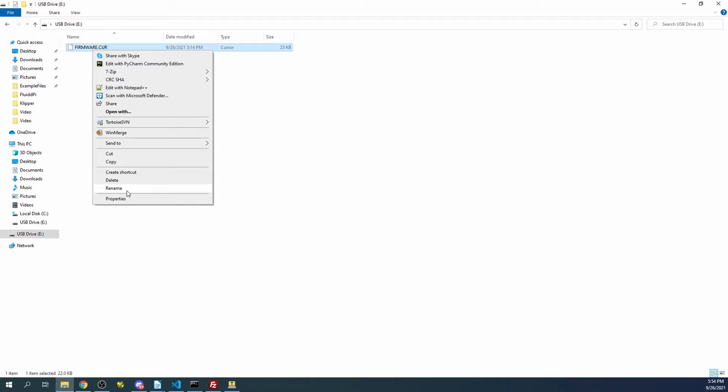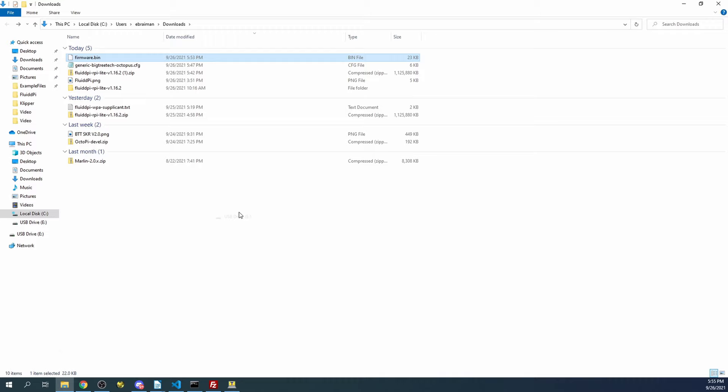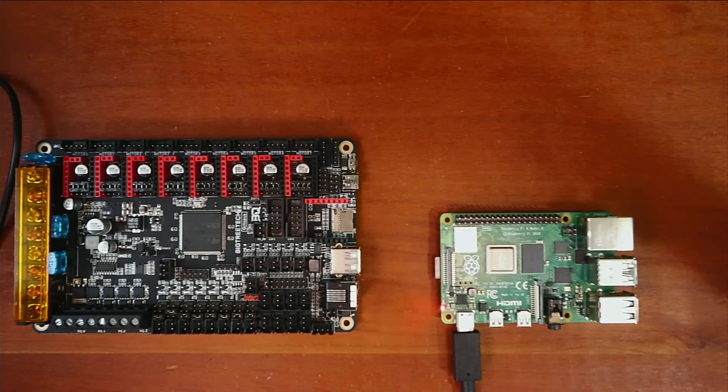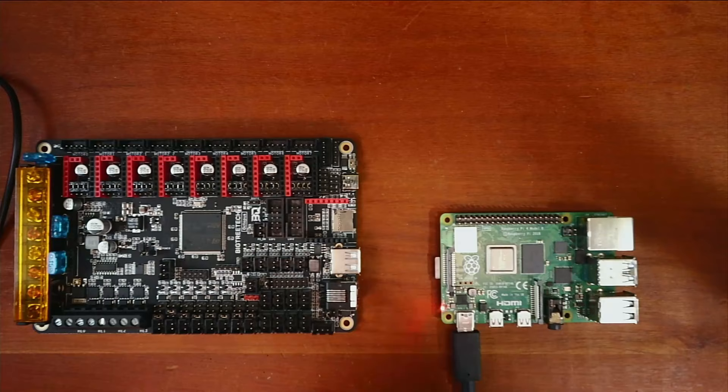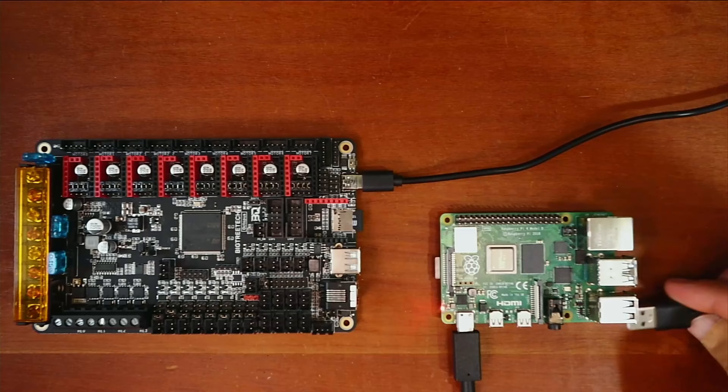If we want to reuse the old firmware, we'd have to rename it to firmware.bin to load it, but we're going to keep it. We'll rename it to temp_firmware.tmp so we know what it is. Then we'll right-click on the new firmware and send it to the USB drive. Then we'll go to the workbench, pop out the drive, place it inside the reader. To power this, we have to be on USB power. I'll connect the cord to the Raspberry Pi and plug this in so it can flash.